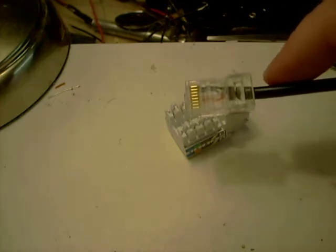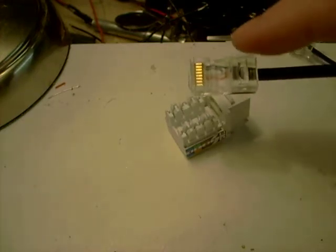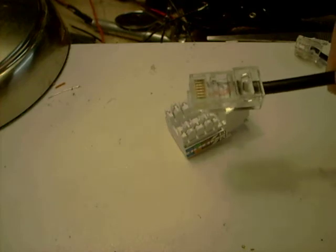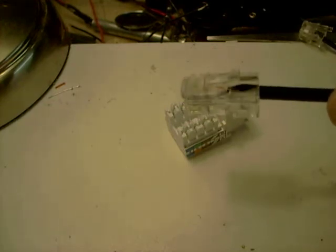We did notice another thing too, since we have all these spare connectors that are not used in this, you could actually go to maybe a 6 or 8 pin wire. Again, using stranded cable, you don't want to use anything solid. You could have other connectors coming from the gun, such as maybe a reload on the vest or a speaker. A pair of speaker wires going to an amplifier on the vest if you wanted to do that as well. So it gave you a little bit more flexibility to be able to add more connectors and do a lot more things with it. So again, we found this to be the best middle ground for the home builder and for us as an easily replaceable, repairable item, and you can get it anywhere.